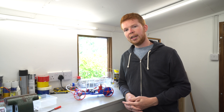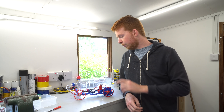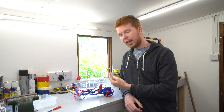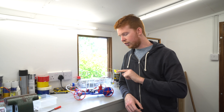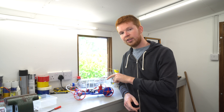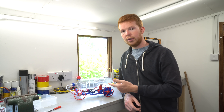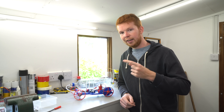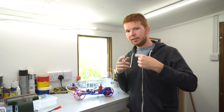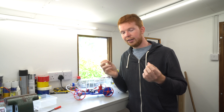So that's the conundrum I've run into when testing this air-powered car. I think the only way to fix it is to completely redesign the engine — either by increasing the volume of the cylinder so that the energy transfer to the flywheel is greater than the energy required to open the ball valve, or by completely changing the valve system and moving to a rotary valve that spins and lets air in and out. The only issue with that is it would be quite hard to seal properly without air leaking out the sides.